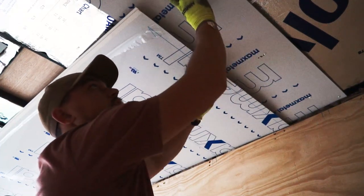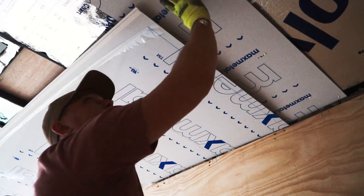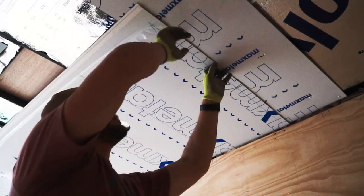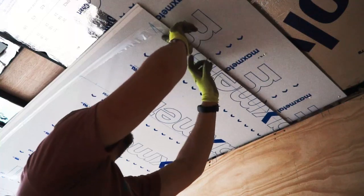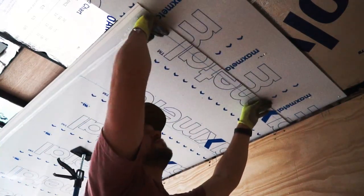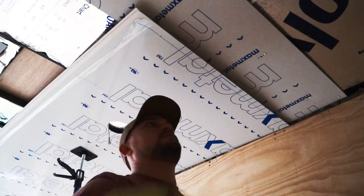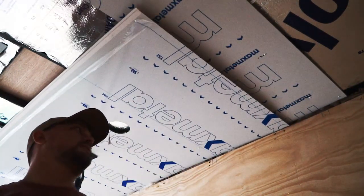These panels are only three millimeters so they're super thin. I installed this panel and extended it over so my ceiling panel will overlap it, and I'll actually use fasteners to go into this which is screwed to a stud. That way this will be nice and flush with my next panel, and the next panel I put up here will connect to this and be nice and flush as well, so all those will tie in together pretty well.